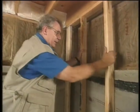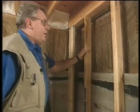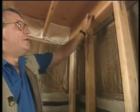Now when they're into place and plumbed as I have here, I'm going to screw these into the underside of the joist. And down at the bottom all we'll require to do is put a nail down through the bottom plate, through the block, and into the concrete.